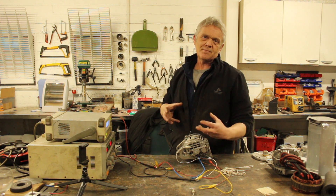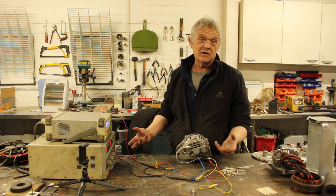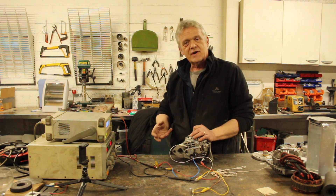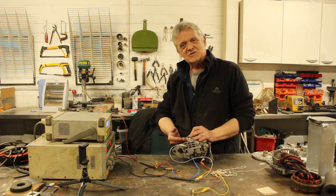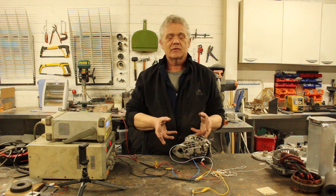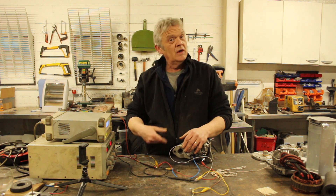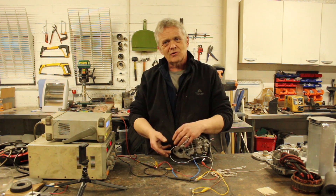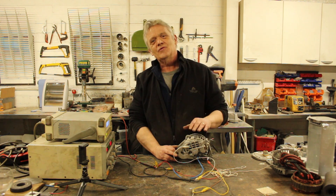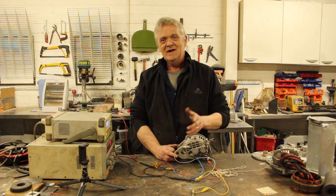There's an awful lot more to these than you might think. If we pull apart the crab claws and put a permanent magnet in the rotor, we can turn it into a brushless generator. If we remove the rectifier and take the three coil outputs separately, we can make it three-phase. If we control the voltage going into the rotor, we can use it for braking and self-control, or feed it straight back in as a feedback mechanism to let it control its own speed. You're using power to run the rotor, but because you're spinning it through that field there's always more power out than in. You might attach a supercapacitor to control the magnetic field strength. Quite a lot you can do with these — quite fancy, quite tricky, and really impressive.